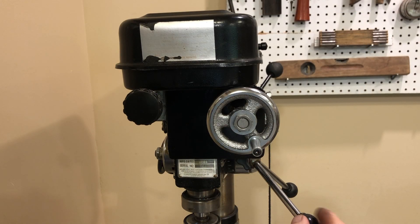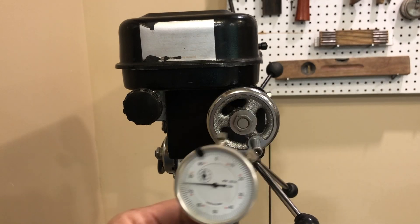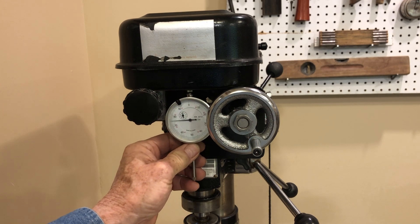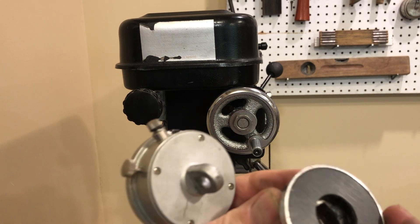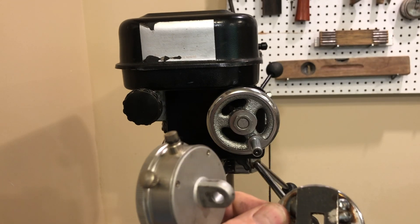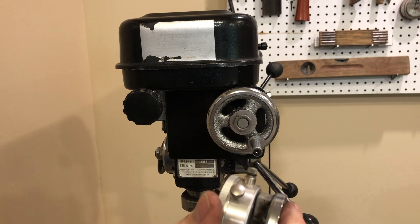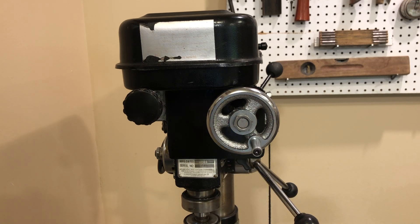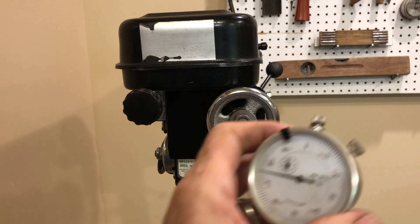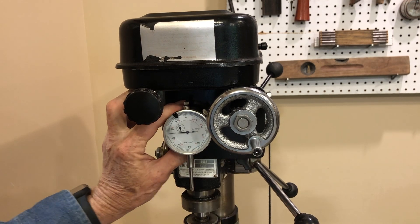I needed a way to keep track of how much I'm moving this head up and down, and I wanted to use a dial indicator. I've got this dial indicator that I use for different projects, but I wanted to come up with an easy way to mount it to this mounting plate. So I thought I would use a magnet — I took just a round magnet and cut out a chunk of steel with a slot in it and a set screw on the side. That way I can mount this dial indicator to the front of my milling jig, and it just mounts magnetically right to the front of my drill press.